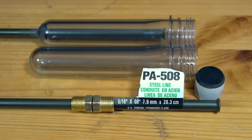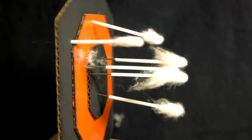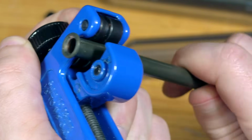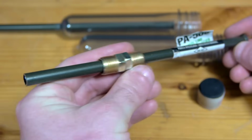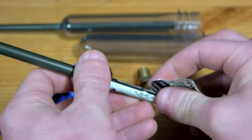For this project, as with many of my projects before, I'm using a steel brake line for the barrel that fits both airsoft pellets as well as my homemade darts. I have a separate video on my channel that shows how I make those darts if you'd like to check it out later. The brake line that I'm using needs to have one of the flares on the end cut off, which can be done with either a hacksaw or with a small pipe cutter like I'm using here. With the flare gone, the fittings on the line can be set aside, and any stickers can be removed as well.